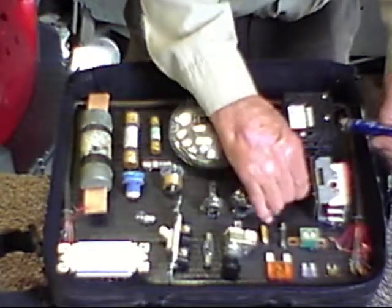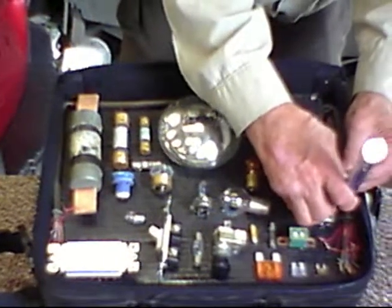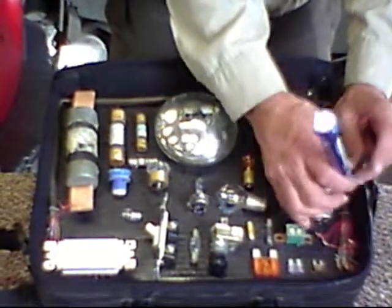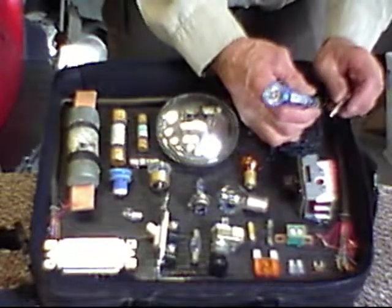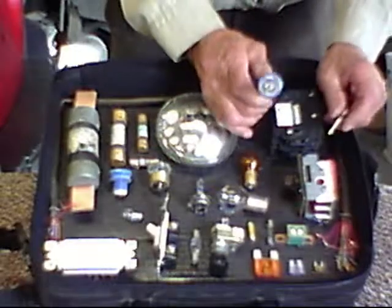If we turn the temperature up, the switch makes the contact. You could actually hear it click, and you can see that that switch is functioning. So if you were not getting heat in your bedroom, this would be one of the first things that you want to check, and that would show you that it's a good switch. You maybe got a bad heater or another problem.